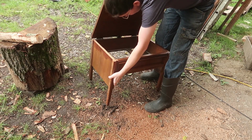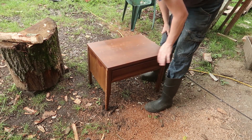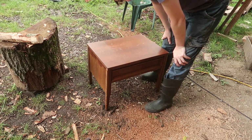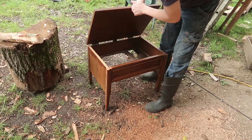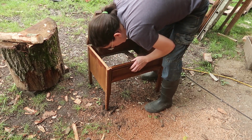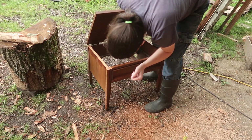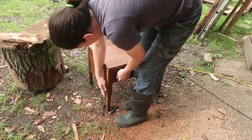Oh, no, it's not. If I was going to make something, I think I'd want it to be really, really sturdy to where it could fall off the back of a moving truck, you know? Especially with this oak that I got. It'd be really nice. I think gluing would be a good option, but I would need to add more fasteners. The glue did not fail at the top, it failed at the bottom. And it appears I didn't pre-drill that enough, so it started to crack this wood anyway, so I'll need to remember to drill larger holes. Yeah, that's all scuffed up.